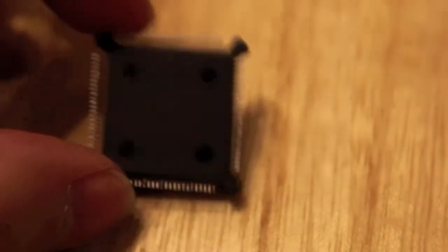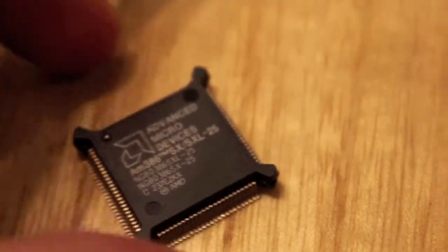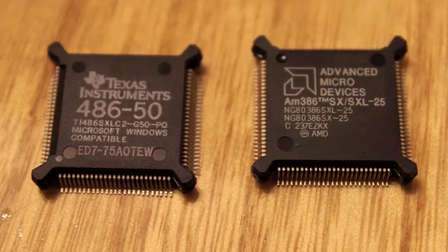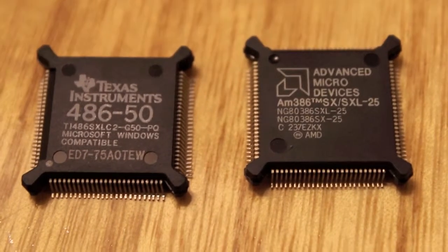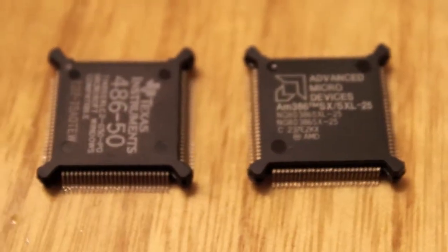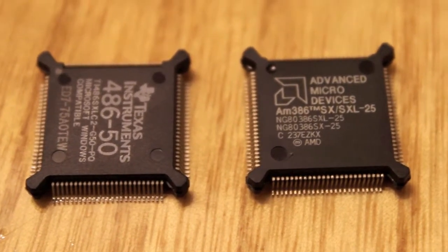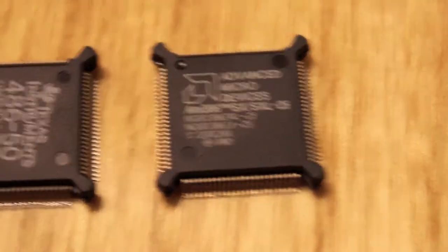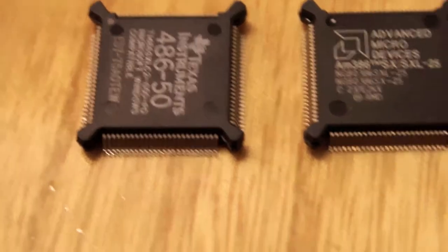It's really hot. It's pretty boring on the underside. There are so many assumptions on this upgrade. One of the big ones is that it will even work. While they do look very similar, just hoping they're similar enough to be exactly the same mechanically. Now I've got to work out how to solder it back onto the board and also the orientation of the chip. According to the notch on the AMD chip, it's in a different corner to this one, so this one should be installed like that. I'm just gonna guess. Texas Instruments, why didn't you use a cool notch like AMD did? Look at that — very nice, very smooth. So on with the mod.